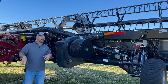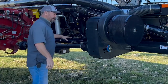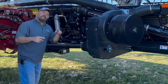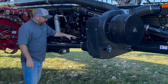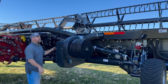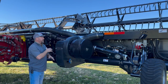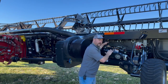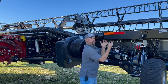To run the air system on this Draper head — this integrated air system — it's run by a PTO shaft. To drive the combine we've only got the PTO shaft on the left-hand side. Here on the right-hand side, this PTO shaft is going to run our integrated air system. The shaft turns, spins the fan, blows the air into the head, and then we've got a series of tubes that will go underneath the Draper head and then come up behind the knives and push air this way.